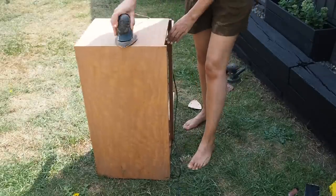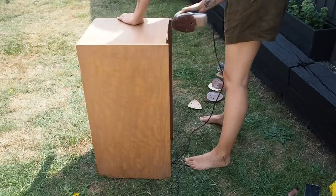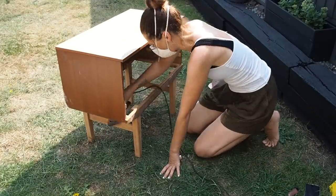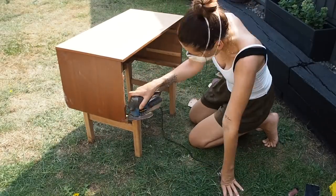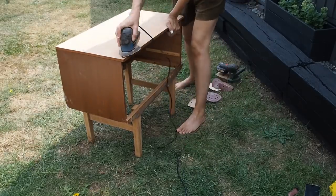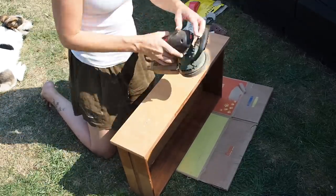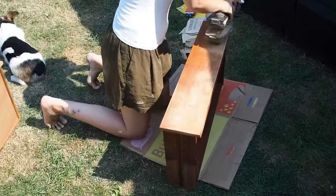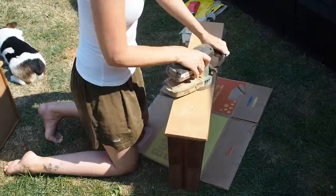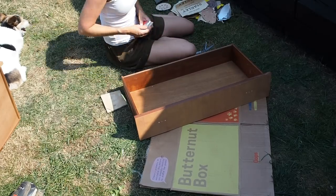While the drawers are drying I go back to sanding a little bit more. One thing to bear in mind is once you've taken that varnish off, the wood is open and prone to marks and staining from grease on your fingers or any paint. So do be careful with your unit once you've taken that varnish off. Then I sanded down the front of both drawers including all that filler using my orbital sander, and all the edges with my detail sander. I sanded the inside of the drawers a little but I'm going to paint the inside and line them with wallpaper so I just did this roughly with some hand sandpaper.